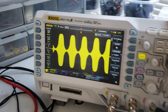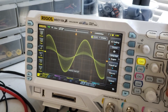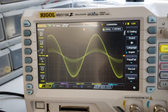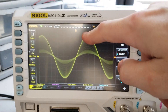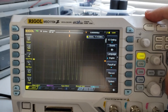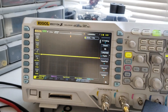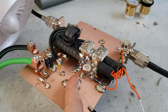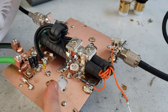500 peak. Here's our waveform — we're going to zoom in. There are no noticeable harmonics in that sine wave, none whatsoever. Not at the peaks, not at the valleys. There are no visible harmonics, which means the harmonics on this amplifier are pretty freaking good. With bipolar transistors, they don't operate much higher than 30 megahertz or so, so they don't really make that much harmonic content.